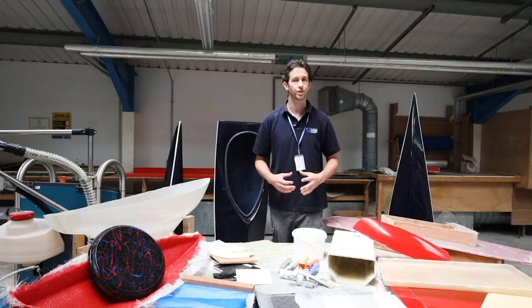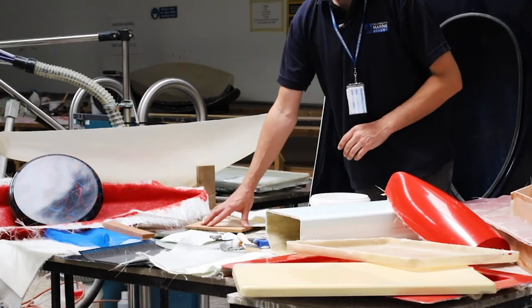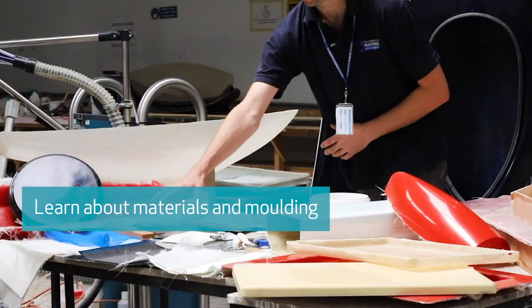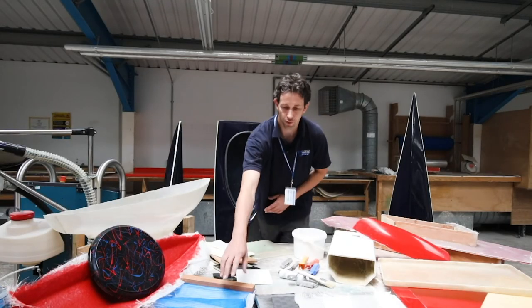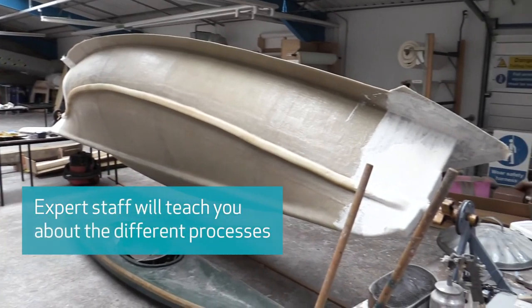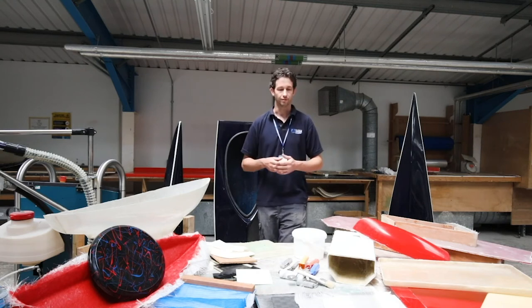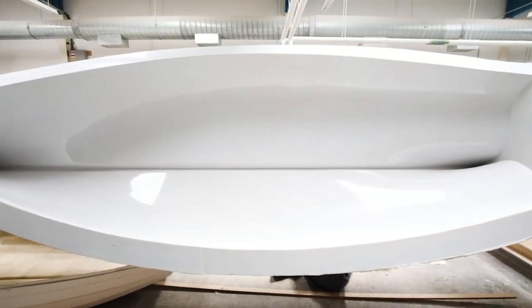We bond these in as buoyancy tanks within the FRP construction. Within that we have core structures, and we talk about the different structures of the laminates themselves — how we can gain lightness in the materials and products. That leads into the different types of materials we could use within the laminate and the process of construction. We talk about hand lay, resin infusion, and vacuum bagging — all described in different variants. You will see videos of ones we've done in the past and will actually get to construct some molds in resin infusion.